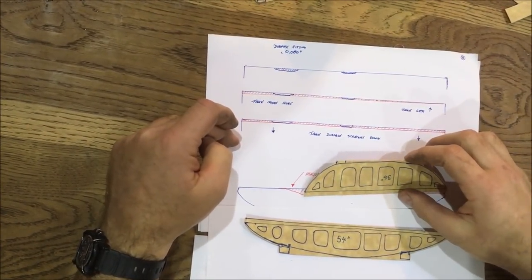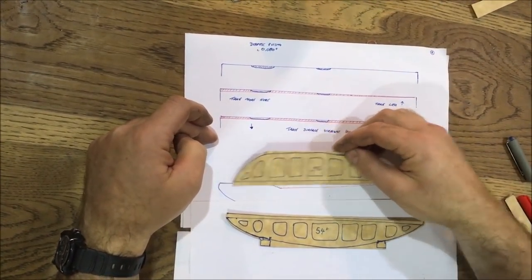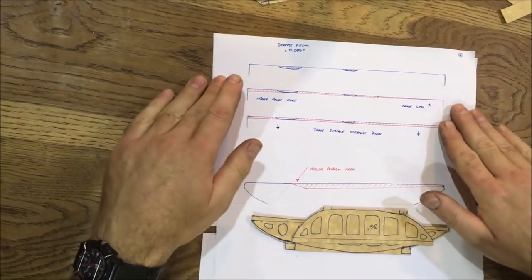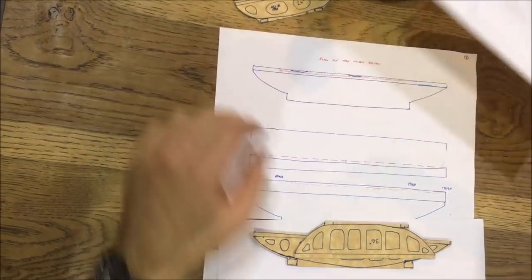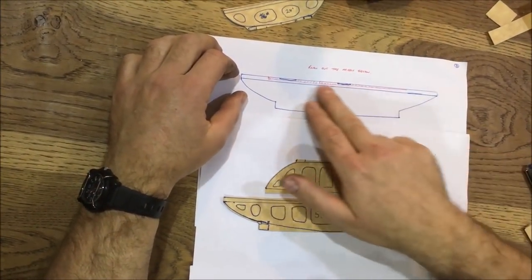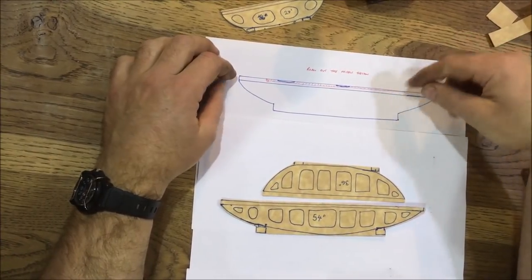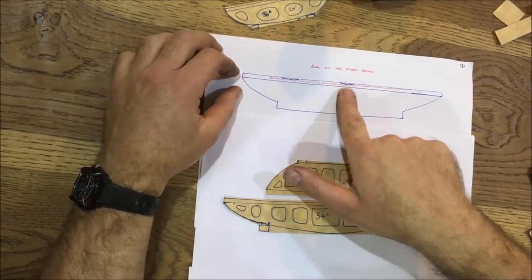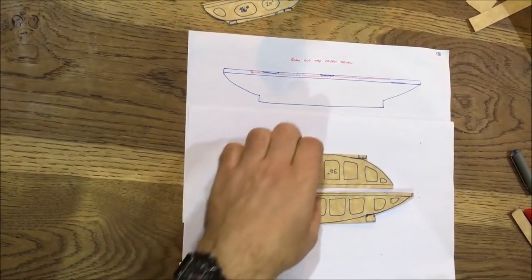So I ended up doing it in a series of steps. So basically taking it down, then taking that bit down, then coming back, taking that bit down and doing that. That seemed to give me a much more repeatable print. So what I ended up with was, for intents and purposes, this kind of setup, whereby I'd taken very little off the good end and had got this to the stage where I was getting a reasonable distribution. And I've just got to bring in the last 18 inches.